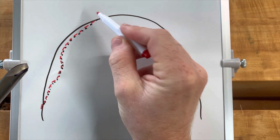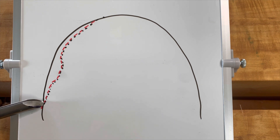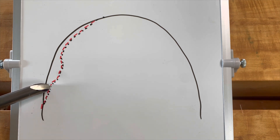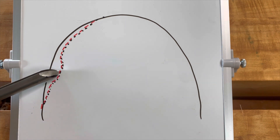To get bevel support the whole way, I come in here rubbing the bevel flat on that surface. The black line is the existing wood and the dotted line is what we're going to make the shape into — we're removing all of this wood. I'll ride the bevel, lift the handle up slightly so the cutting edge starts, then turn the handle to keep the bevel parallel with where I want to cut. Coming through, I lower the handle to follow the contour, then bring it back as needed — riding the bevel all the way through.